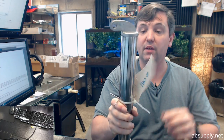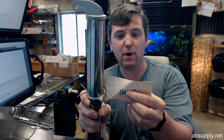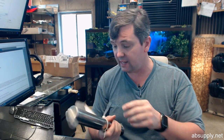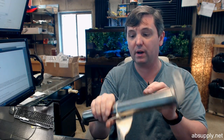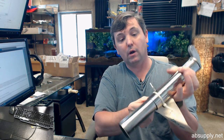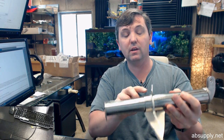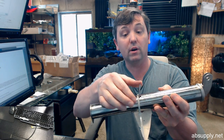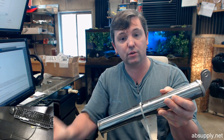This will arrive to you under tension. The tag that's on here saying 180 pounds, that's probably just a generic tag from their far more common RPRS1SSE. That should be marked as 100 pound. This is a 100 pound unit. And once it's installed firmly, when the pin is on there, or the strap, you're just going to cut this strap off. It's really not doing anything. And then you're going to remove the pin carefully, keep everything under tension, under pressure, so that it doesn't explode on you, and work to compromise your mounting point, top and bottom.